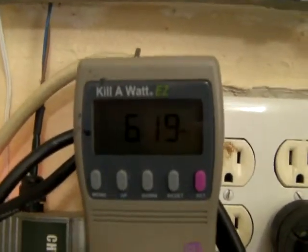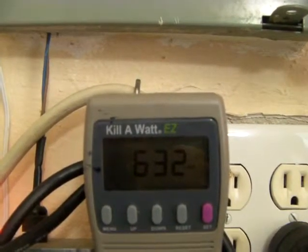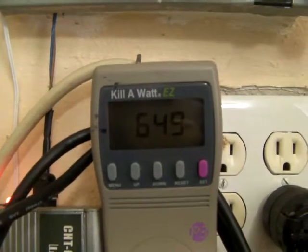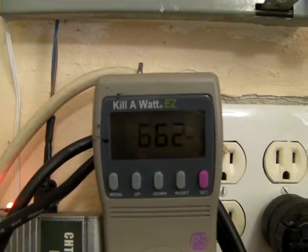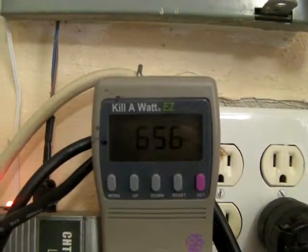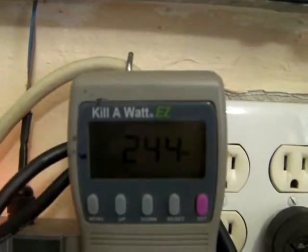Right now it's around 1 PM, and wow, it was cloudy all day long, and right now we're producing 650 plus watts. I only have 8 130-watt panels, and 3 banks of 2 panels in series. Only these two grid-tie inverters are producing, and we're producing around 650 watts.